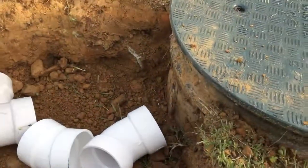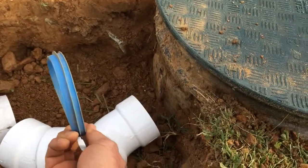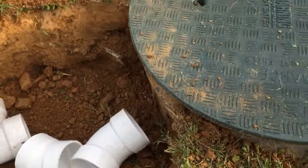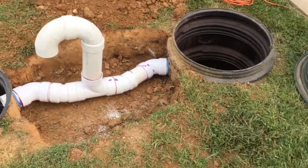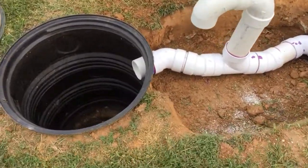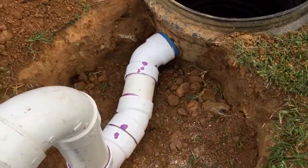Here's a rough layout: this guy will be sticking up vertically above grade. There are the flat spots — I'm going to cut that out. I have gaskets from plastic distribution boxes for drain fields; I'll trim the hole, snap them in, and they've got a lip so you stick your pipe through and that seals it up. There's the finished product — the two ends are connected. A four-inch pipe will certainly handle enough air. There's the penetration where it comes through the plastic riser and the blue ring seal on the other side.